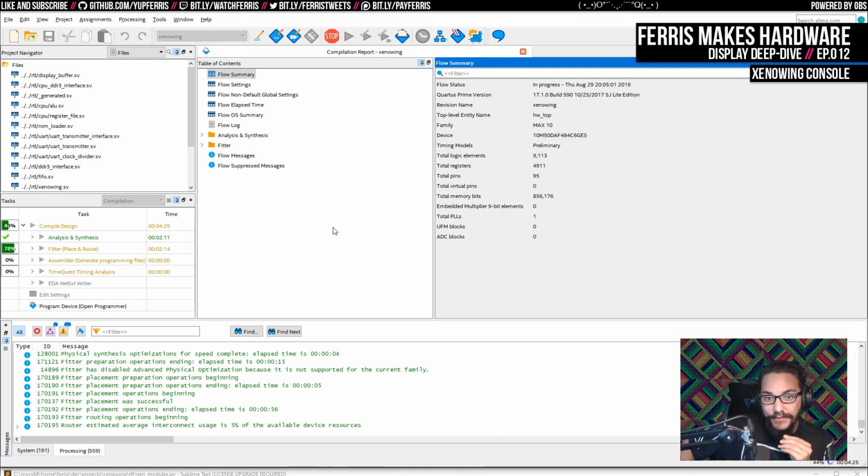So, but definitely because of this memory latency that we saw earlier, caches would really help. Essentially every time we hit memory for reads, because we don't have to wait for stores to come back. So whenever we do reads, that's a 20 cycle latency at least.